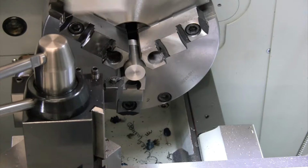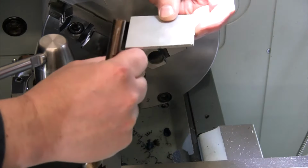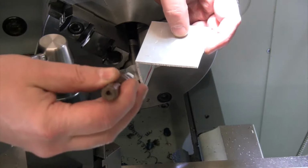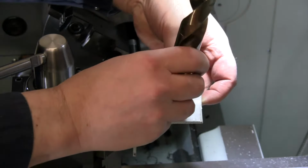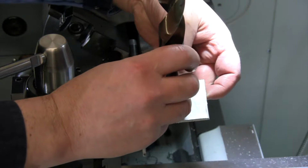All right, so before we can sharpen up our larger drill bits, what we want to have is a little post. We're going to mount that post inside of this piece of angle iron. We're going to hang that on the wall, because all of your larger drill bits are going to have a center hole in the bottom of them. And then we'll be able to put that drill on that post and lean it and mark it onto the marking plate that we are also going to put on the wall.